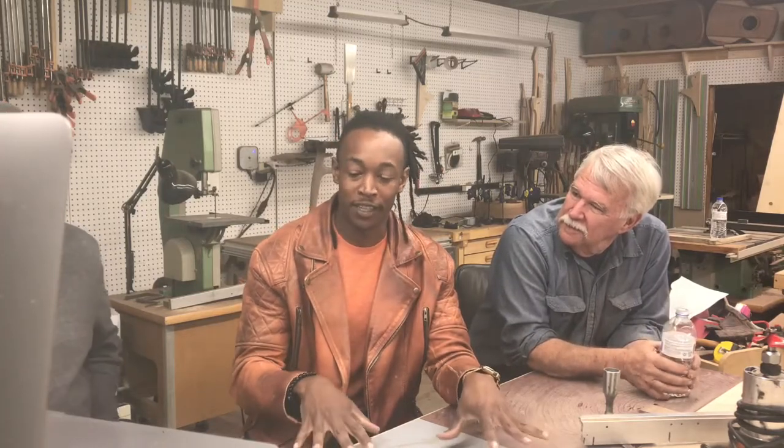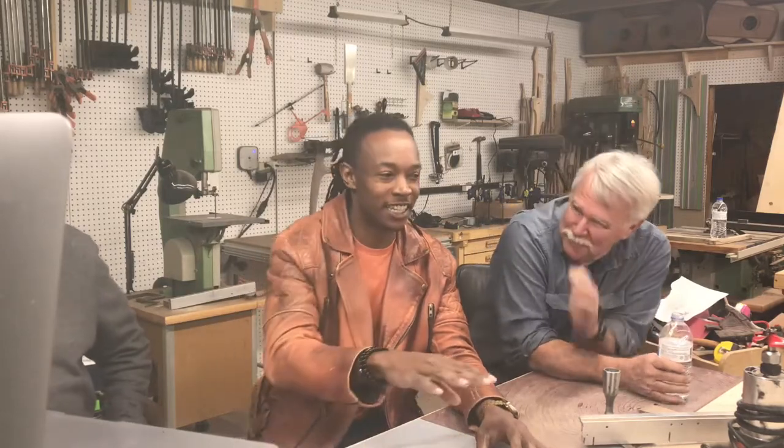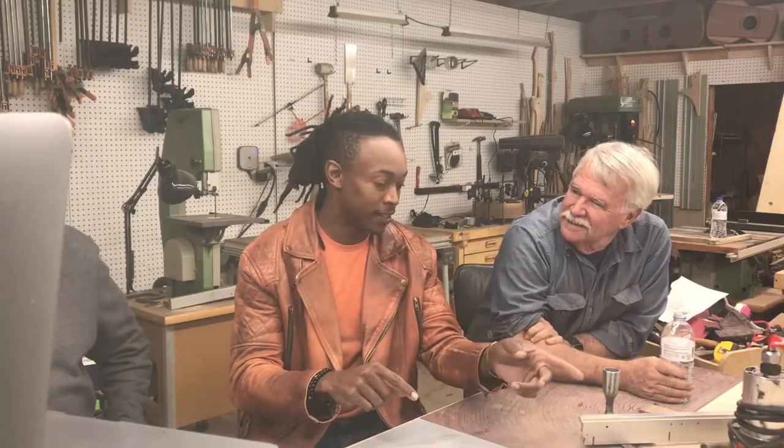There's actually 2 more I will add to that. I had an employee who was in a hurry and tried to cut a piece he just glued up. Wet glue. Wet glue will set off your saw. And then right after he replaced the cartridge, he set it off again, because he finished the cut and he did not wait after the saw was off for the blade to come to a complete stop. And he let something touch it, and it triggered it.